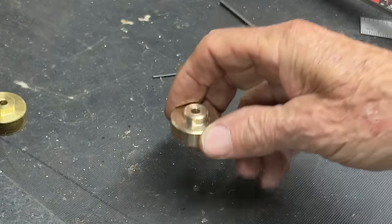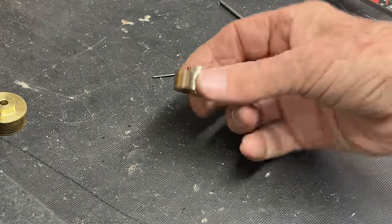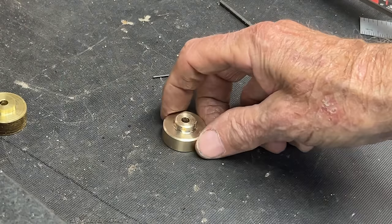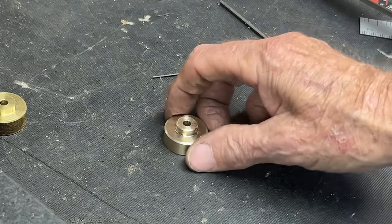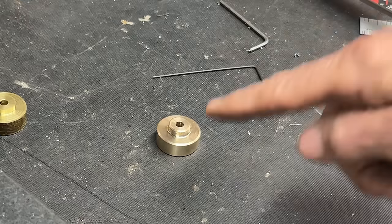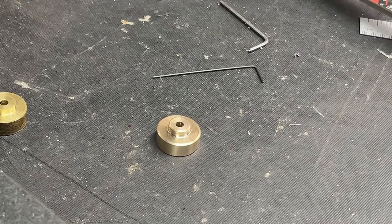One other thing I wanted to say is when you use drill bits in brass, if they're brand new bits, they've never been used on steel, they will cut like crazy. But if you have a drill bit that you use just once or twice to drill steel, it will be a struggle. So if you could have dedicated tools for brass, it would be a big plus, but we don't, and how would we ever keep them straight, especially in a multi-person type of shop?